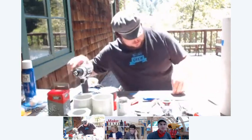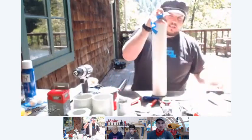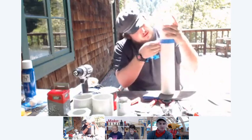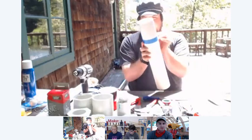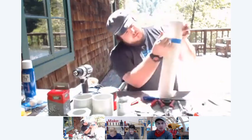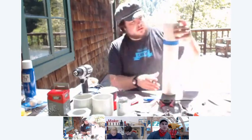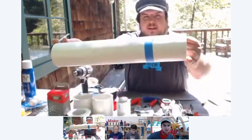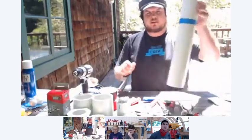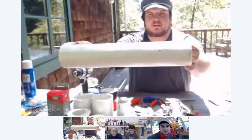All right, then we're going to take our tape. We're going to put it back on the pipe. And so now, with the marks on the tape, we know exactly where to position the electrodes. So just put it on the same spot, wrap it around, make sure it meets back with the other tape. And when you're done with that, you can make your tick marks. So I'm just going to do a line and then a little T. All right. I don't know how well you can see that. Yeah, so that's a clever way to make sure we have four accurate points equally spaced on the circumference. Okay. All right, and you can take your tape off. That's all you need. And you can see our tick marks. There's one right there, and then there's one right there.